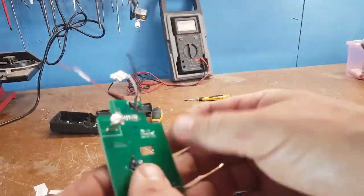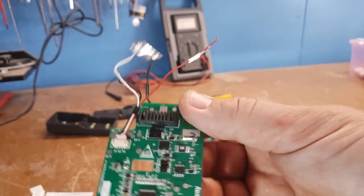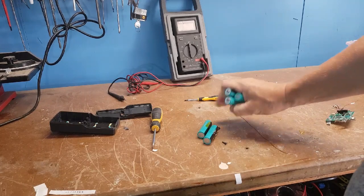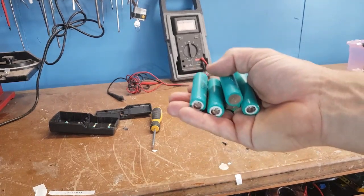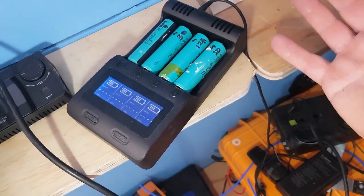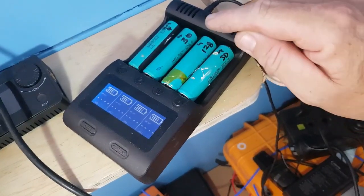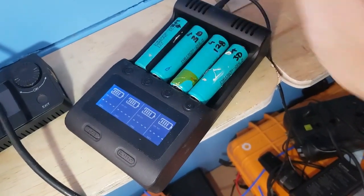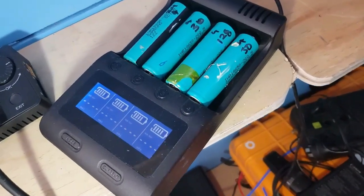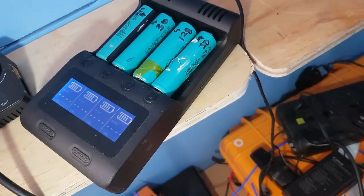I'm going to start testing these. I'd say they're going to come up at about 2,000 milliamp hours — 2 amps as everyone calls it — but we'll have a go at it. Just a quick test to start: all the batteries were sitting at 4 volts. The resistance on one was 128 milliohms but all the others were 30, and the one up top was 24. So they'll balance pretty well for a five-cell system.